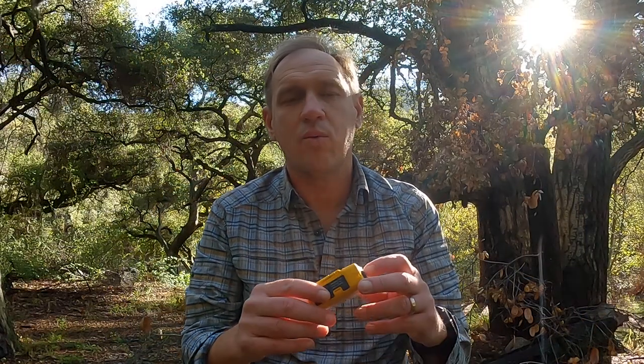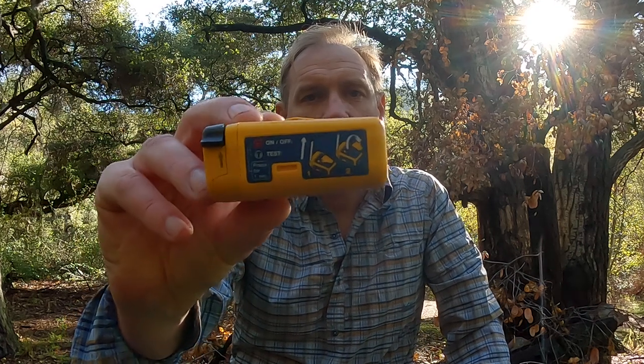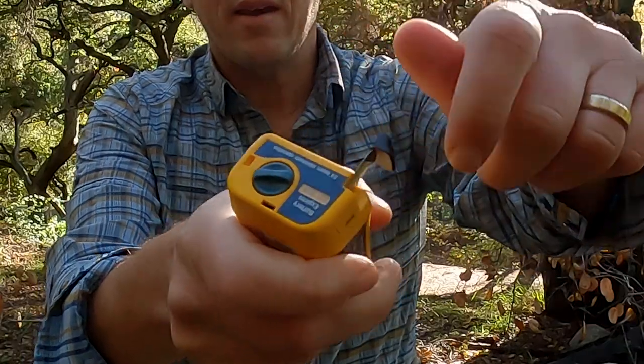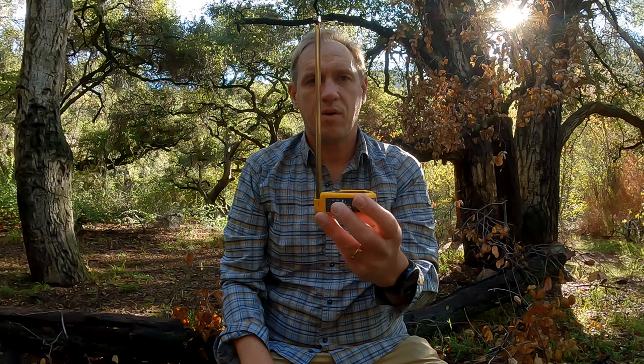Now let's talk about using this thing. As we go through the steps, I'll explain what's happening behind the scenes so you understand the dynamics of what goes into a rescue and a broadcast from a personal locator beacon. If you ever forget the instructions, they're printed on the side of the device and also on the side of the float pouch. The first thing you're going to want to do is deploy the antenna — you can see there's a little spool control there to bring it back in, but to bring it out you just simply pull on it and let it sit with the antenna up somewhere flat.